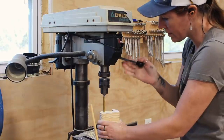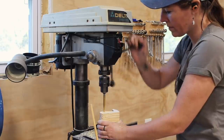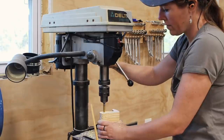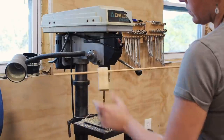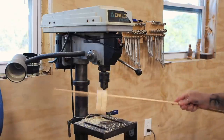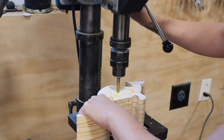The legs pivot on the body by way of a dowel, and you want this to be a tad bit oversized from the dowel size you're using so that the legs will be able to move freely. I recommend having your dowel on hand when you're drilling these holes to test fit it and make sure that the part can easily spin. Here you can also punch through to make the eye hole and the hole in the heel.